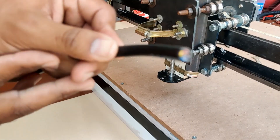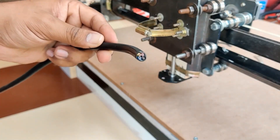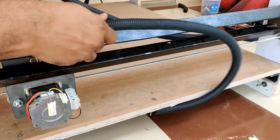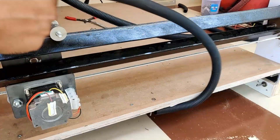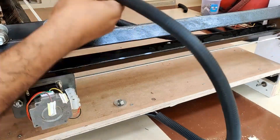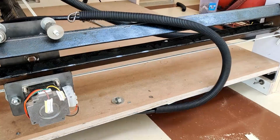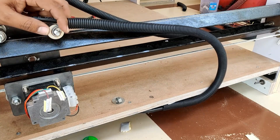These are the cables I'm going to use — let me tell you right away this was a bad idea. These are four-core cables with a shield; they turned out to be very high maintenance, not flexible enough. But I went ahead since I had them lying around. You can buy something simpler and thinner. Anyway, inserting them into the insulation pipe is very easy — just go ahead and insert and pull out as much cable as you need based on where you're going to place the controller.